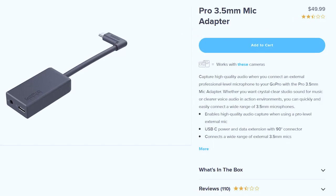The thing is, lapel microphones come with a 3.5mm jack — typically a 3-ring jack, known as TRS. That's not going to be good enough, so we need a way to convert the 3-ring TRS into a 4-ring TRRS, and then convert that into USB. It's worth noting that if you're using a GoPro, you can get an accessory from GoPro to attach an external microphone, but the reviews weren't great. And if you're just using a laptop webcam and want to enhance your audio with a lapel mic, this setup is going to work great for you.